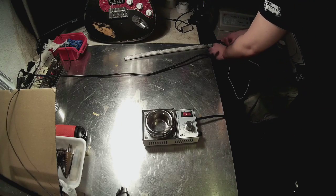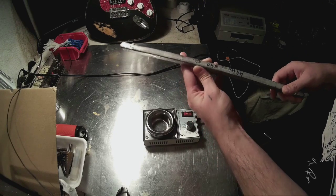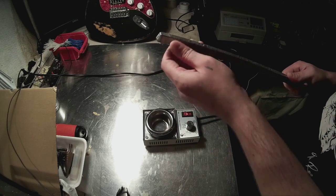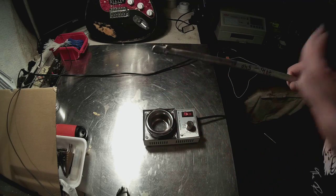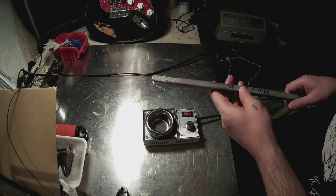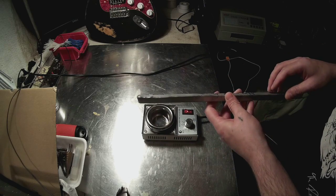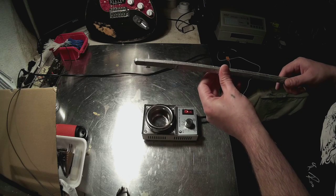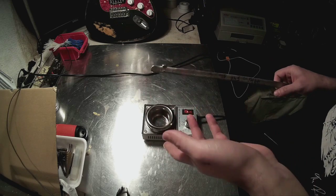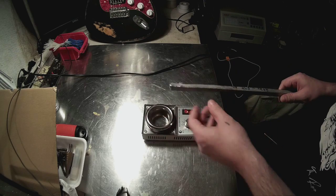I'm going to show you what kind of solder bar I'm going to use. It's called LP-60 here in Romania — it's a 60-40 solder bar with no flux. It's quite important to use no-flux bars because if you use flux solder you'll have to let the flux burn in, which produces a lot of smoke and toxic gases. This one is quite safe because there is no flux in it. Also, lead starts to oxidize around 600 degrees Celsius, so it's quite safe to use even indoors.